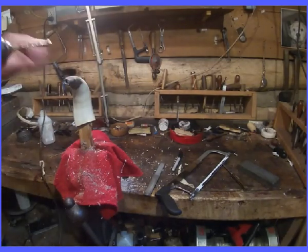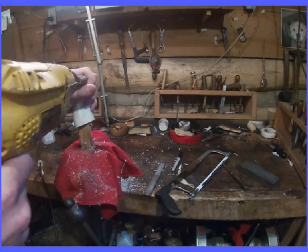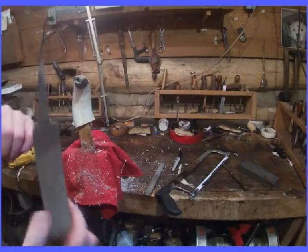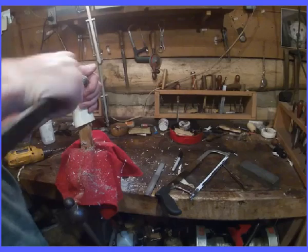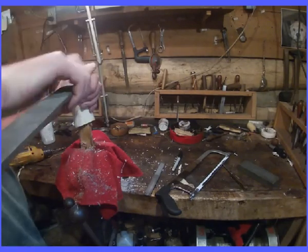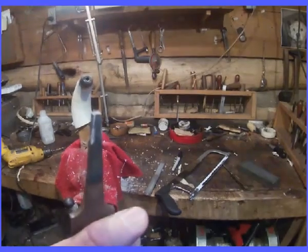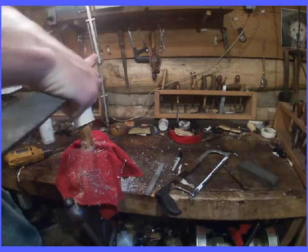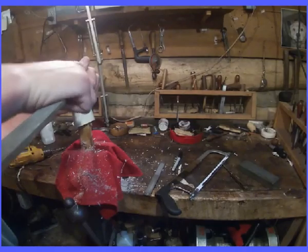So I'm going to take a 1/4-inch drill and then drill through it. Make it a little bigger. And then I'm going to take the end of a file and file it open a little bit more. This is just a file without a handle. Any file will work, and these sharp corners act as a reamer, and it makes for a tapered hole. This will make the powder flow out of it nicer and also make it easier for you to get a seal on your peg.